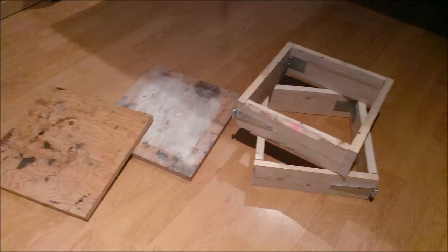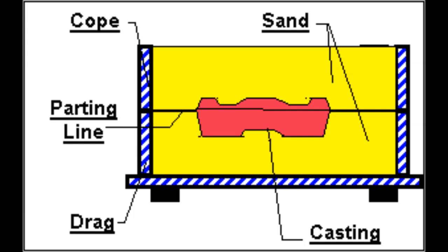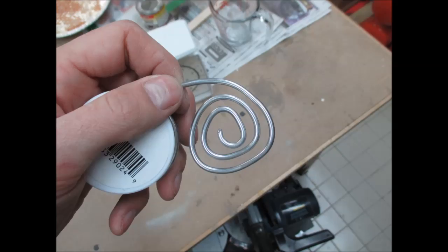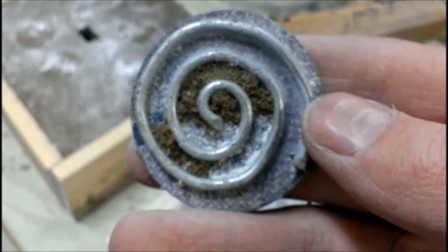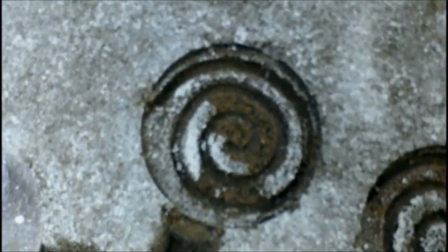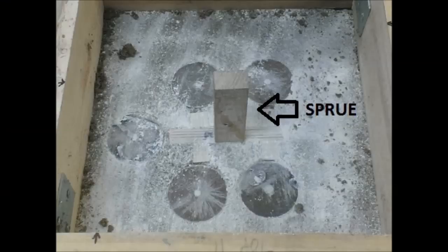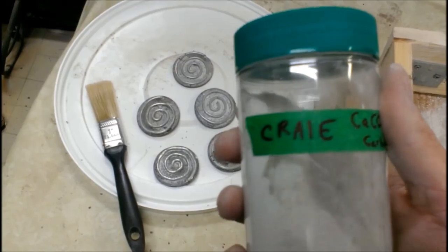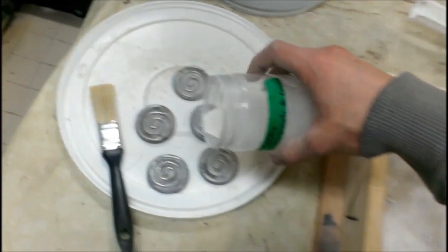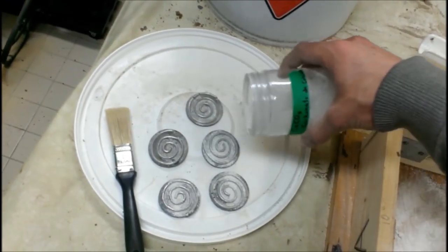Apart from green sand, you need two plywoods and two identical flasks. I built my flask with 1x4s. The upper flask is called the cope and the bottom one is called the drag. A pattern is used to create the shape of the cavity in the sand — the pattern can be the part itself or a wooden model. I built a model from a wood panel and thin wire. Avoid any negative angles, as the sand gets trapped and it's impossible to remove the pattern without breaking the sand. You also need a wooden model for the sprue and the runners. The sprue is the opening in the mold where you pour the liquid metal; the runners allow the liquid to circulate inside the cavities. Finally, powdered chalk is used for its hydrophobic properties — it repels water and prevents green sand from sticking to the wooden parts.